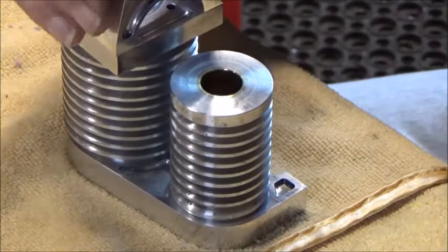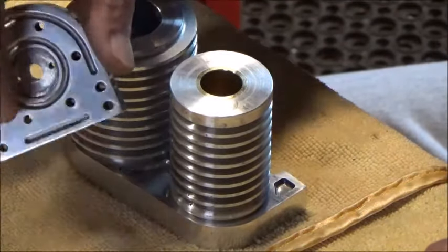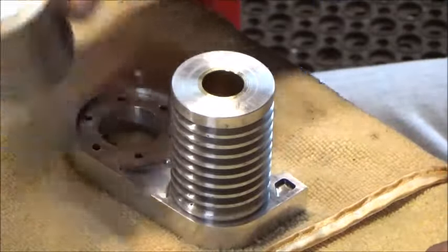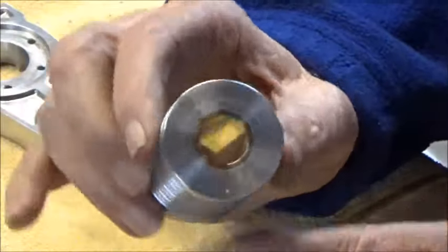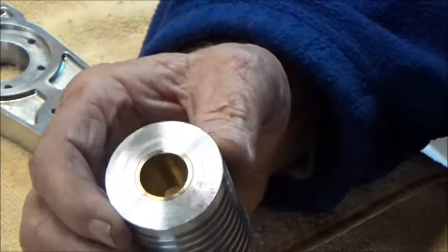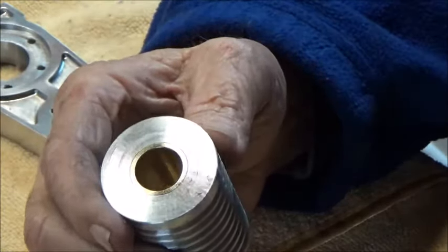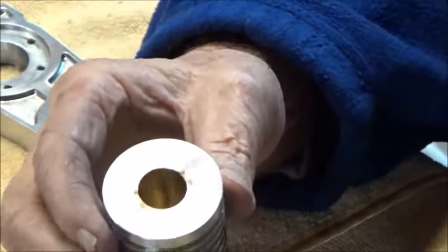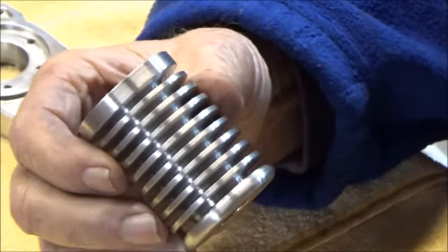This is the rear frame up here — that's done. Here's the displacer cylinder — that's done. And here's what we just did. We put a brass sleeve in there with a 16th inch wall on it. It's 620 thousandths ID — it should be 600 according to the plan, so we're 20 thousandths over. I think that'll be fine; I don't think there's a problem with that. We just cut all the fins the same as we did on the displacer cylinder.